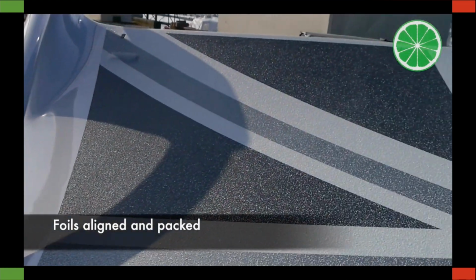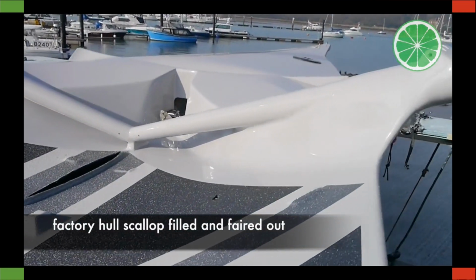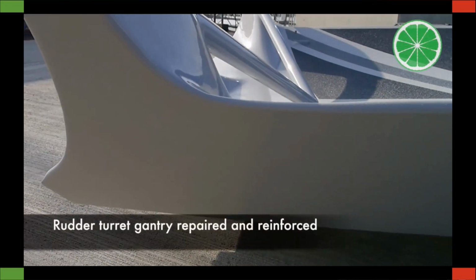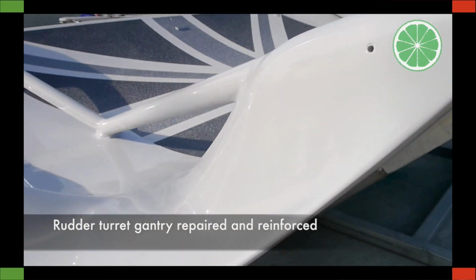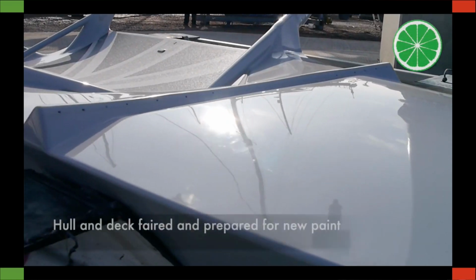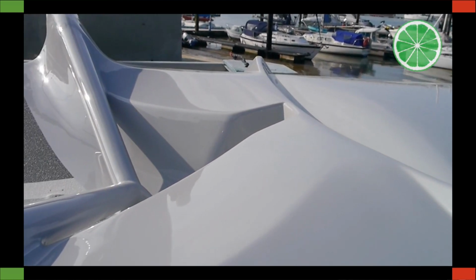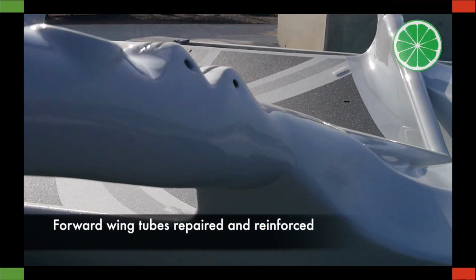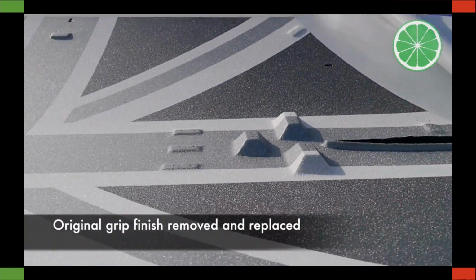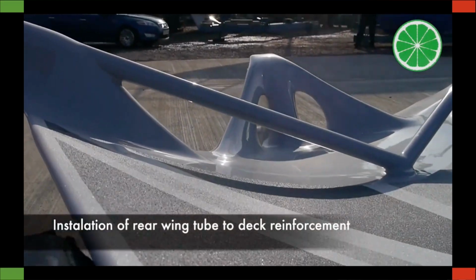Yeah, like any boat workshop, ours is 6 degrees to 30 degrees throughout the year, and we've never had an issue with spraying it out of a 2mm needle, not thinned at all, or spraying it thinned. I've only ever really gone as low as a 1.4 with it, but again, 30% thinners to give you that finish that you can just flat out. And there's never a moment where it's not gone off all the way through, depending on how thick you put it on. The only thing you've got to be careful of is your overcoating time with darker colours.